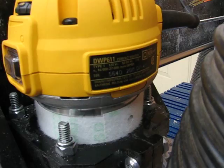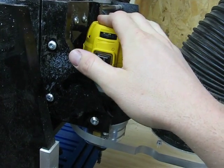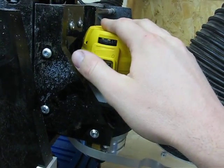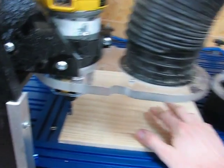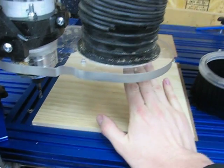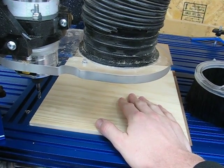You can sort of see the 611 there. I really like it. The Colt is rated at 1 horsepower, this is rated at 1.25, but it really seems like it's a lot more than that — it really has a whole lot more power. The Colt would really bog down when you ran it in pine with a quarter inch end mill. Even with a four flute one like this, it would really bog down. If you ran it more than about 50 thousandths cut at 120 inches a minute...